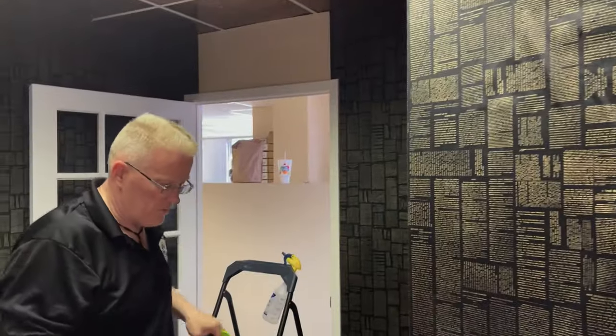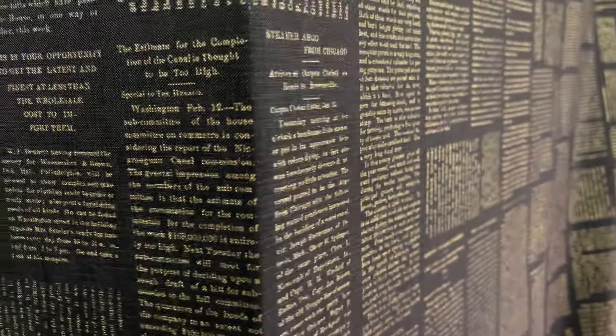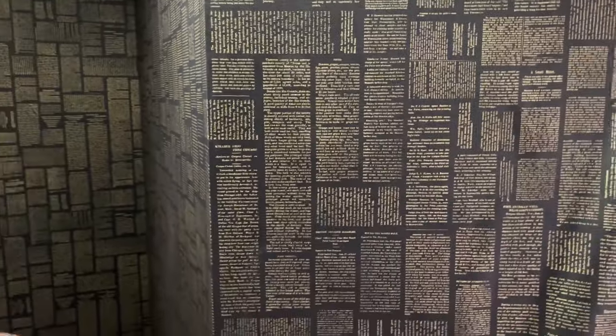Just to show you the difference, if you can now bring them in and just show them the corner and several inches on each side of it, how nice and tight that corner is. You see there's no air underneath that corner. You can't get this wrong. If you're off on the corner, you'll never be able to fix it with commercial vinyl.